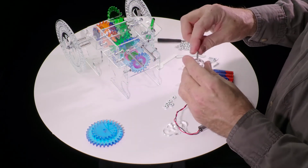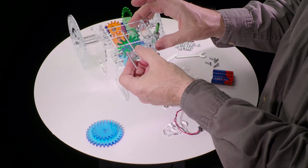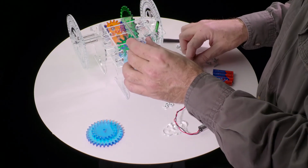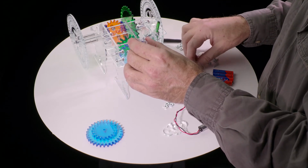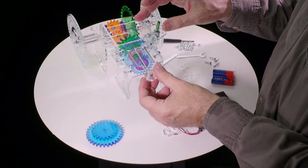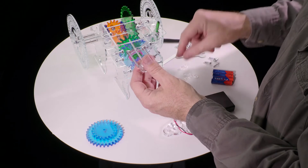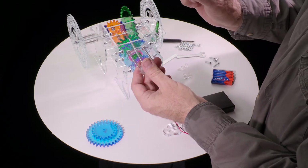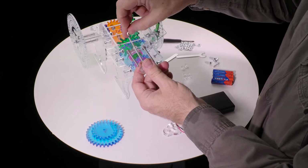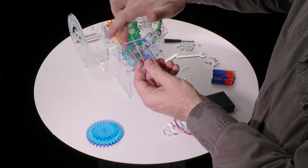Okay, so this is now going to go through here like that, but we need to get it the right distance through. We'll start with a 5mm washer, goes through there, and we can't just stick it all the way through because we have to get all the nuts and gears on as we're going. So the first thing is a 3mm washer, goes on there, and then a nut. And it's easier to turn the shaft to get the nut started.